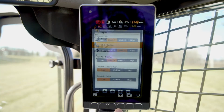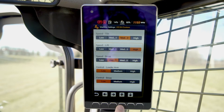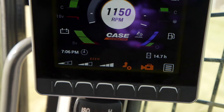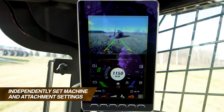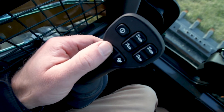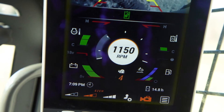Taking it a step further, we have simplified considerably the more advanced electro-hydraulic control settings, where you can individually set tilt, lift, and drive speeds, as well as loader arm and control aggressiveness to meet the specific demands of each job and operator. The fourth button on the front of the display allows the operator to save these settings to a custom profile and simply recall them the next time they are in the machine or face a certain application. Each B-Series machine with electro-hydraulic controls also comes with creep speed, which allows for improved operation of attachments such as cold planers and brooms. Creep speed sets a lower consistent machine speed and allows the operator to independently set attachment speed for optimal performance based on the application.